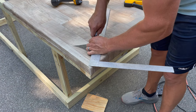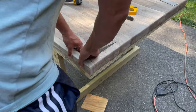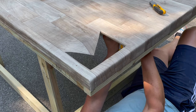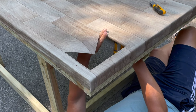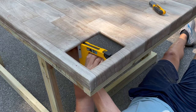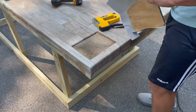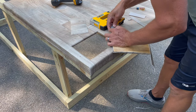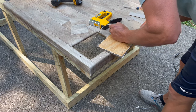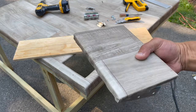I found the corners of where the plywood was cut, then cut my linoleum and folded it up to staple it. If you have an off-brand stapler you might find it has a tough time going into the plywood or even the pressure treated wood - it's probably worth investing in a good staple gun for this. This was probably one of the most obnoxious parts of the build: trying to get the linoleum to wrap and get it stapled on there. I put a good bit of excess on, which allowed me to pull it tight, and then cut off the excess after I had it stapled.